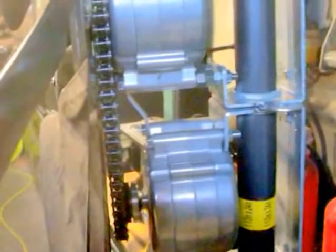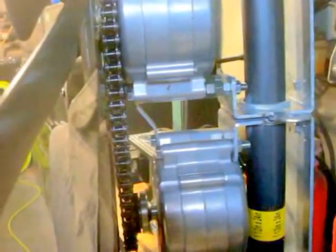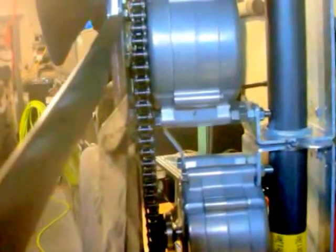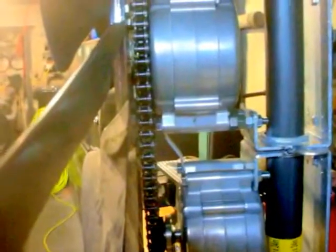I made a modified turbine. This one's chain-driven, unlike Ian's which has a belt-driven one. I don't want to use a belt because belts slip, and when they do they squeal. So I put a chain on there — it won't slip. It's probably going to be more noisy and it's going to rust, but a box of chain is like 10 bucks, so if I have to replace the chain every year I could probably do it three or four times without having to take anything apart.